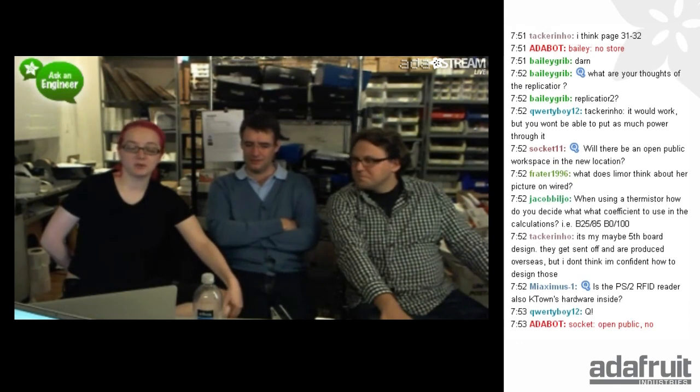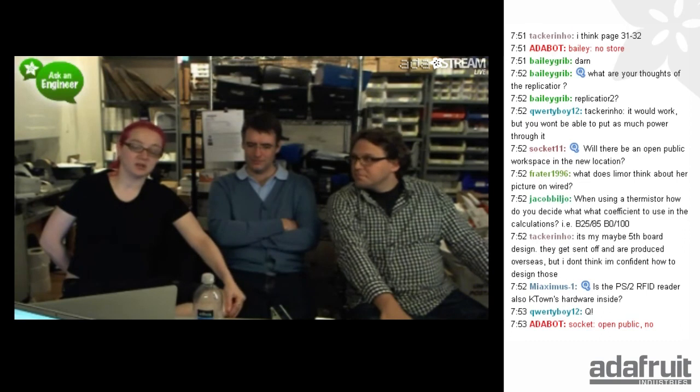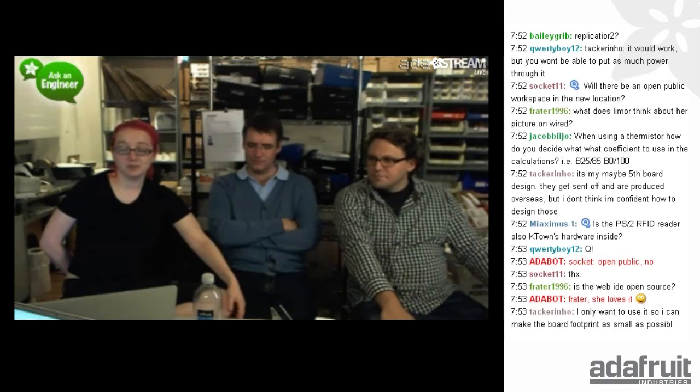You can, but it depends on how much current you're drawing through it. You do have to calculate your power dissipation through the package, and then look up the thermal resistance of that package. It's probably in the datasheet, and then you can use a thermal calculator, or just do it by hand to figure out whether you're going to be dissipating too much power. You can put a heatsink on top of it, but it's pretty small. Probably just put vias underneath the thermal pad to a ground plane as they request. It's in the datasheet, you should probably do it.